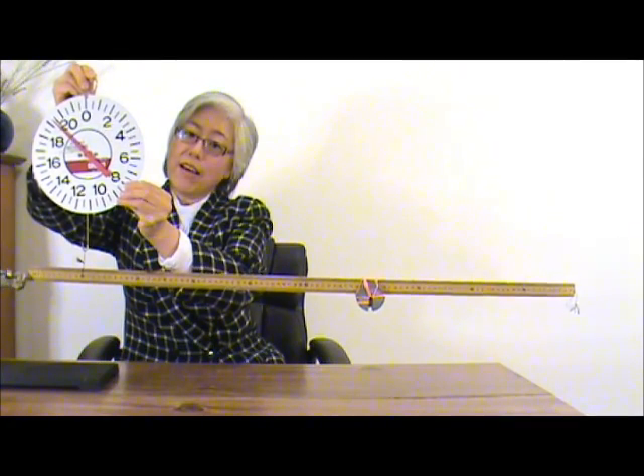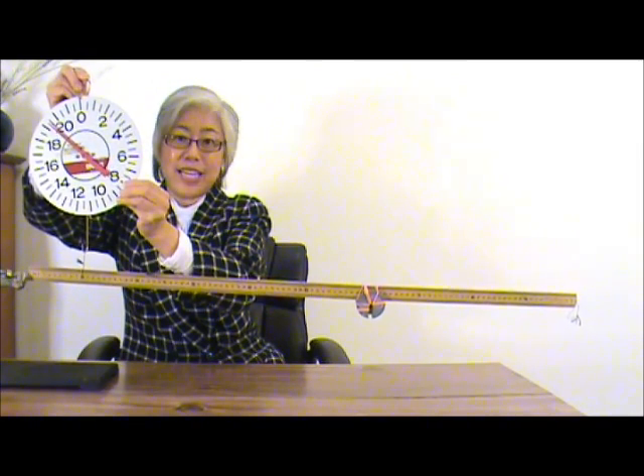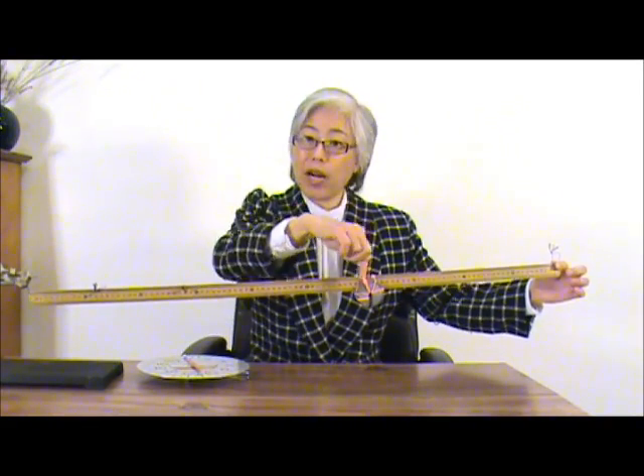What about the 10 cm marking? How much force do I need? About 20 newtons. 10 cm is one-tenth of 100 cm, so the force has to be 10 times the 2 newtons. The scale reads about 19 newtons, not really 20 newtons — probably because the axle is really at the 0.2 cm marking instead of 0 cm. To provide 2 N·m of torque: 2 newtons at 1 meter, or 4 newtons at 0.5 meter, or 8 newtons at one-fourth of a meter, or 20 newtons at one-tenth of a meter from the axle.